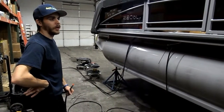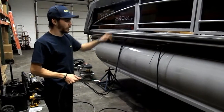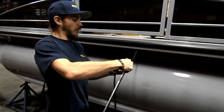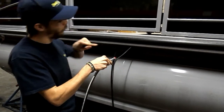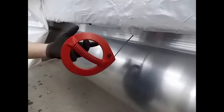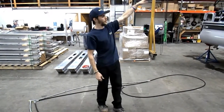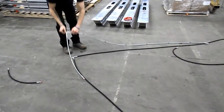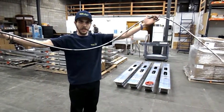I've got my holes cut in the bottom of the boat and I know where I'm trying to get my hoses. We're trying to get our driver's side hoses over to the other side with the sheeting up here. I got my fish tape and ran that all the way through the pontoon. I've got a little zip tie set up here - I'm going to put my driver front extend, zip that right in there, cut off my zip tie, and he'll pull that all the way through. Then we'll run it up by hand once we got it on the other side. I've got my green and my yellow hoses ran across my driver's side since I mounted the pump on the passenger. Now we're looking at our crossover hoses - they're going to be our retracts. So we're going to hook in yellow and red to this side, this will run down, hit that cylinder, and this will run across the boat and go down to hit the other cylinder on the bottom.